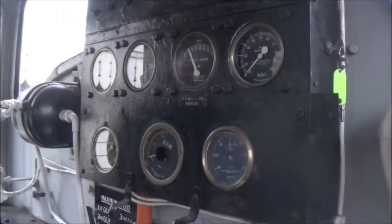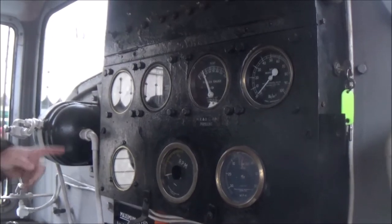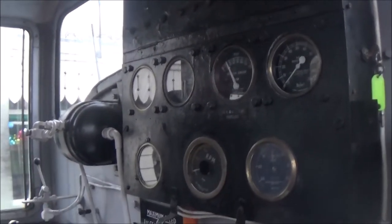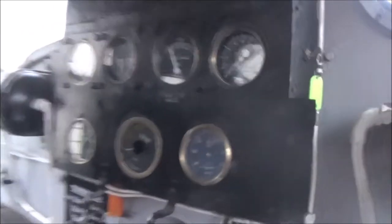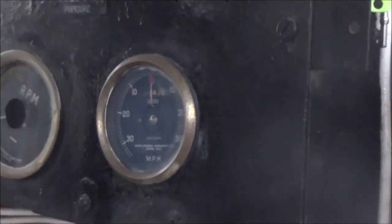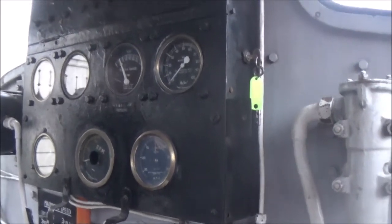This gauge is your engine oil pressure. We don't rev it up until we can see the pressure going around the whole engine - especially important on a cold start. Wait until there's a good bit of oil pressure before revving. The speedo works in both directions, going backwards and forwards, and we're limited to 10 miles per hour.